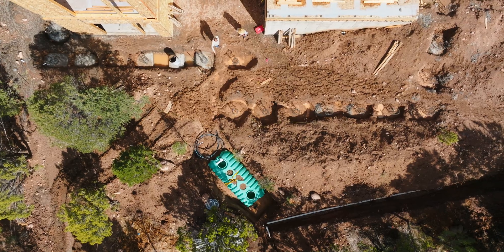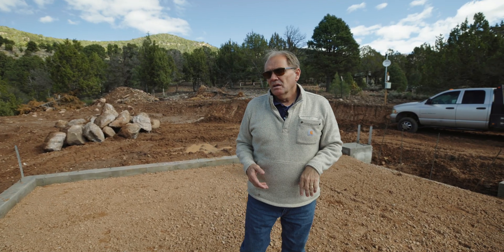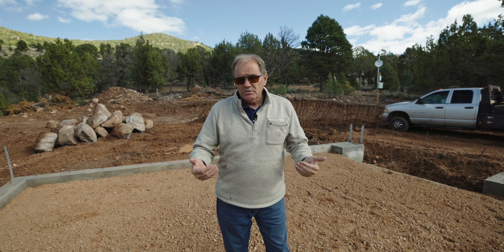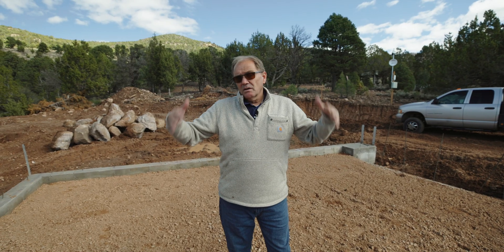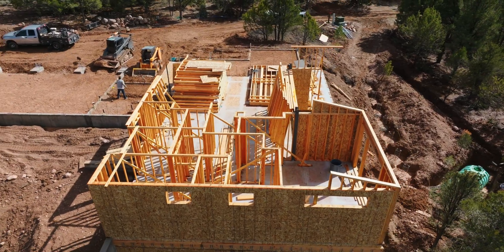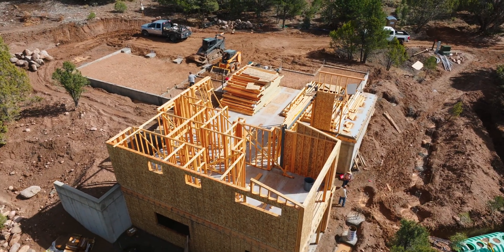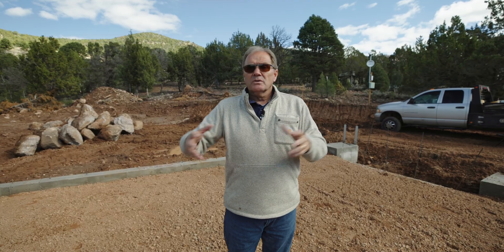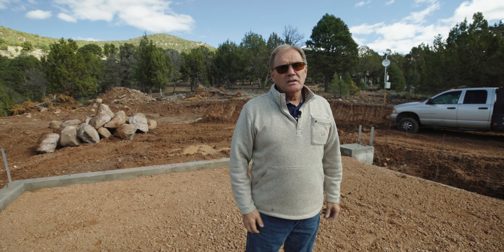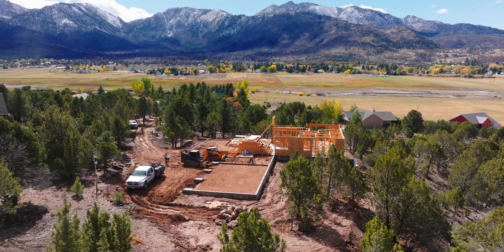One thing I don't like is doing my grading at the very end. I like to get that done as soon as I can because weather is going to hit it, and when weather hits it, it actually helps to settle the soil down into place. We're going to finish the septic next week and get some grade around here. It's wet, which is a great time to get that grade done — getting ready for the winter. We're going to be building this home during the winter. If we can get a dry-in — a full frame structure with the roof on, synthetic on the roof, and a full ice and water shield on the entire roof — then if weather hits us before we want it to, we'll be okay. We can have mechanical come in for plumbing, electrical, HVAC, and insulation. We had our first frost last night, dropped down to about 39 degrees Fahrenheit.